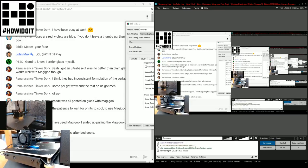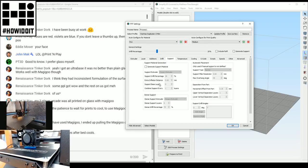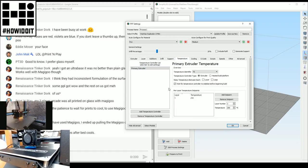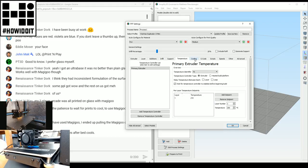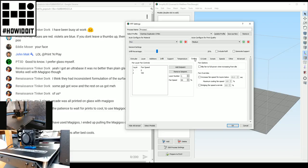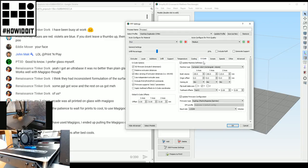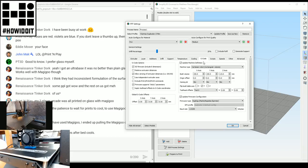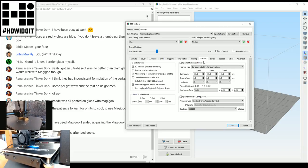Just want to check here real quick. Yeah, you guys can still see the printer printing. It's at 7% currently. Temps 210 degrees. There is currently no heated bed. Part cooling, that really doesn't matter because there's not a dedicated part fan. I doubt the heat sink or the heat break fan is set up for multi-speed, or being controlled by speed.